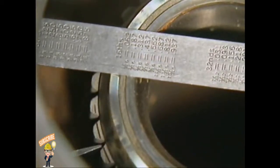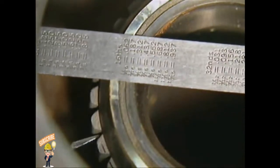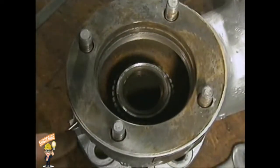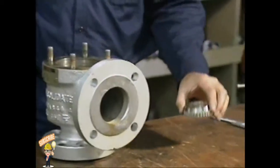Write down the total number of notches that you counted. This number will be used to install the ring correctly when the valve is reassembled. Remove the rule and unscrew the lower ring until it disengages from the threads on the valve body, then set the ring aside.